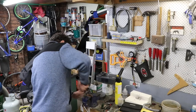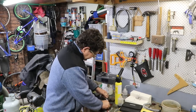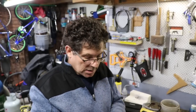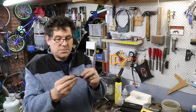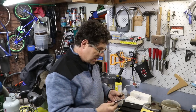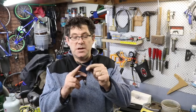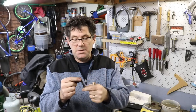This is the third attempt — the others weren't too bad but I learnt a few things along the way. The first one I tried cutting the flutes while it was hardened and that didn't work. I also ground the flats while it was hardened and didn't machine off the clearance — those were all the mistakes on that one. On the second one, I also forgot to machine the clearance; I did a ball-nose flute which was better, and better grinding overall.